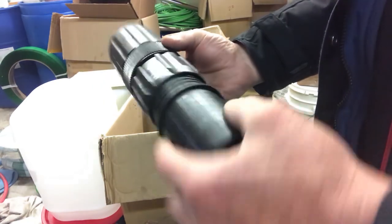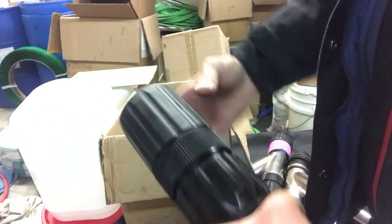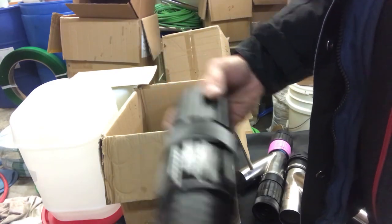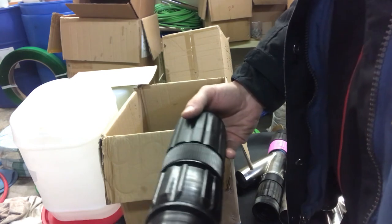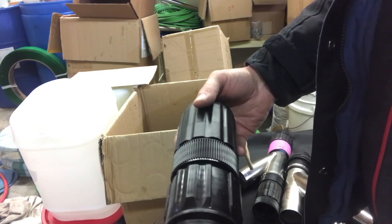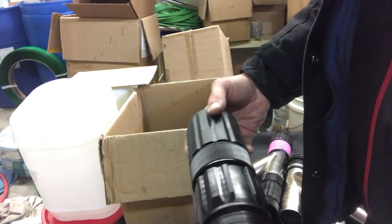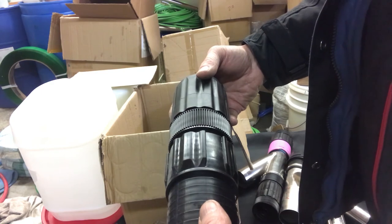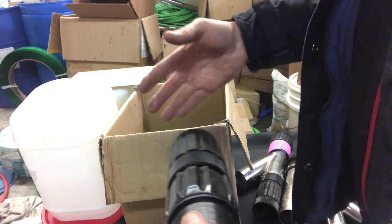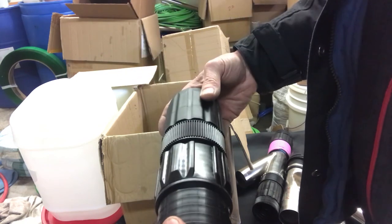Following the Fireman's Rule, the males point towards the job. The female screws onto your two-inch hose going inside — you're done. For a two-and-a-half-inch setup: one two-and-a-half starter cuff, one two-and-a-half swivel set, one barbed reducer, one two-inch swivel set — that gets you 150 feet of two-and-a-half. For multiple lengths of two-and-a-half hose, buy one two-and-a-half swivel set for every 50-foot section. Some guys use two 50-footers and cut one in half, giving them the equivalent of three sections so they can pull off a 25-footer when needed.